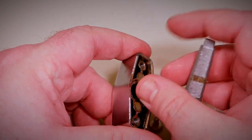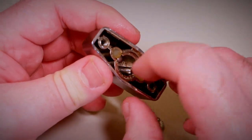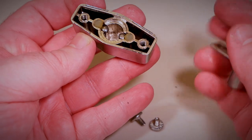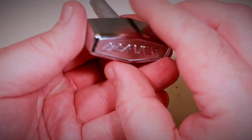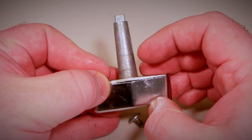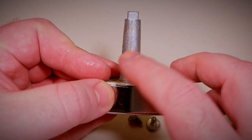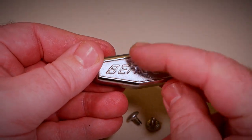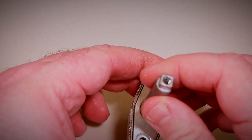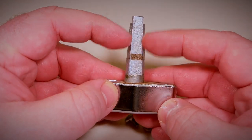The handles between the Beaver and the VIN Master are not interchangeable, and I'll show you why. If your handle is upside down, that's not a problem — if you put enough torque on it again, you can flip the handle back to its proper side, or take it apart. The thing you want to make sure of is that the flat portion of the drive — the part the gear connects to — is flat side up, along with the top of the letters 'Beaver.' So long as the top of 'Beaver' and the flat part of the drive are in the same plane, the handle is in its correct orientation. You apply enough torque to flip it back, or just take it apart. Be careful — there's grease and stiction in here, and sometimes those roller pins can come out with the handle, so you have to reset those as well. It's not as fiddly as it sounds.